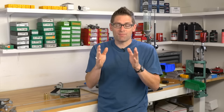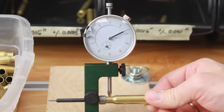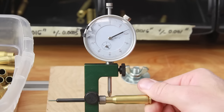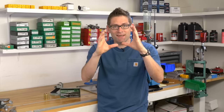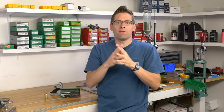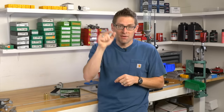Super critical aspect of precision rifle reloading. I've shown tools like the Redding case neck uniformity tool, and that's the other purpose you'll have for the ball micrometer — to check the consistency of case neck thickness all the way around the case mouth. This is important because if you have consistent case neck thickness, you're going to have your bullet perfectly centered in the bore as it engages the rifling, and it's going to spin perfectly straight, which translates to more precision.